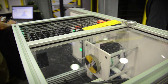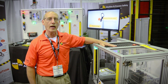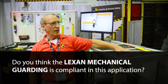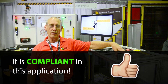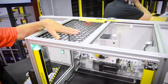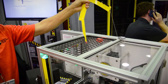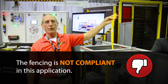So now we'll talk about the mechanical devices that protect you from a hazard, and we're still talking about whether it's a compliant or non-compliant solution. The two I can show you are the Lexan panel and a wire mesh cover. Thinking about compliance — can I reach the hazard through this Lexan panel? It's very obvious that you can't. But think about this one: now you've got openings where you might have access into the hazardous area. This is what people typically call the gotcha stick. If I can reach through an opening and reach the hazard, I don't have proper safety implementation — that exposed hazard is not a compliant solution.